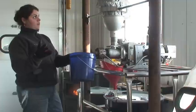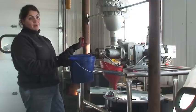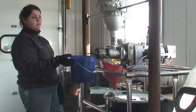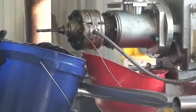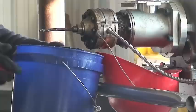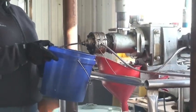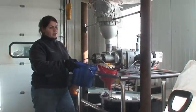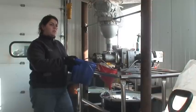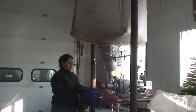You can turn it off when you're done with the seed and clean it out when you're ready to use it again, or clean it right away — it doesn't make a difference. This machine can run about 600 to 800 pounds per bag. At a setting of between 59 and 64 hertz, it will take about 20 hours to press. We can increase or decrease that speed depending on operational needs.